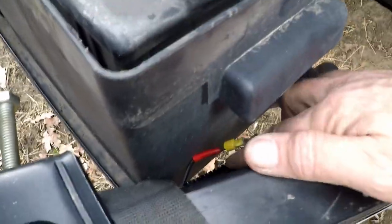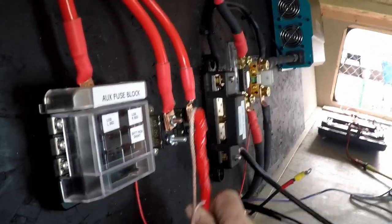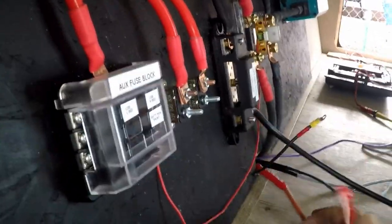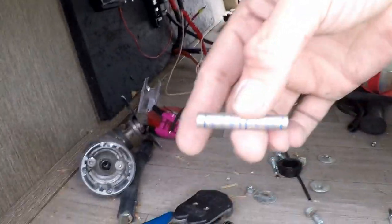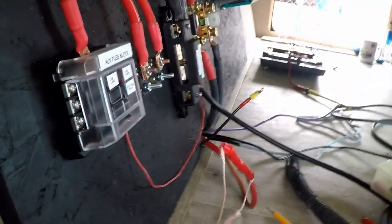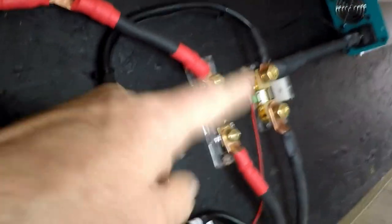I haven't moved it yet, but I have wire for that. This wire right here needs to be run inside, along with this wire here - so those three wires are actually going to go to one of these two resettable breakers, and this other wire will go to the other one. I had to extend one wire - I was eight inches short of the original run. I wasn't going to rerun a whole new line to the back of the trailer just for eight inches, so I used a butt connector and crimped that in. I'll go ahead and get those two mains connected and put together.